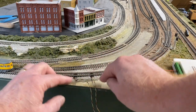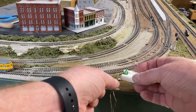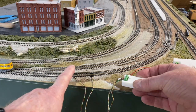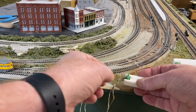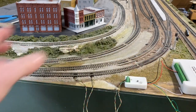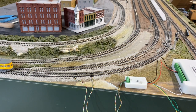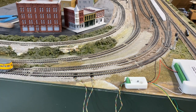So we just have the two sensors. I have five wires coming out of each of these — two are power, two are data communication, and one wire tells me which one of the two it is. I'll just plug this in. When we turn power on, for all sensors in the Model Train Technology world, the blue light will flash four times, and that tells me that all communication between the sensors is live and working. There are the four flashes — so we're ready to go.